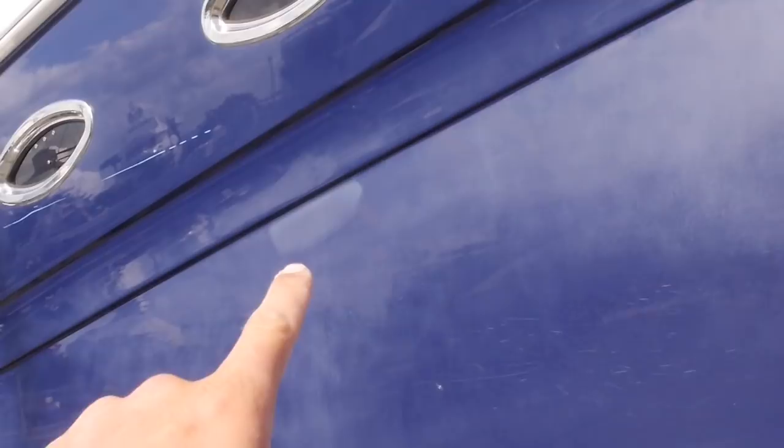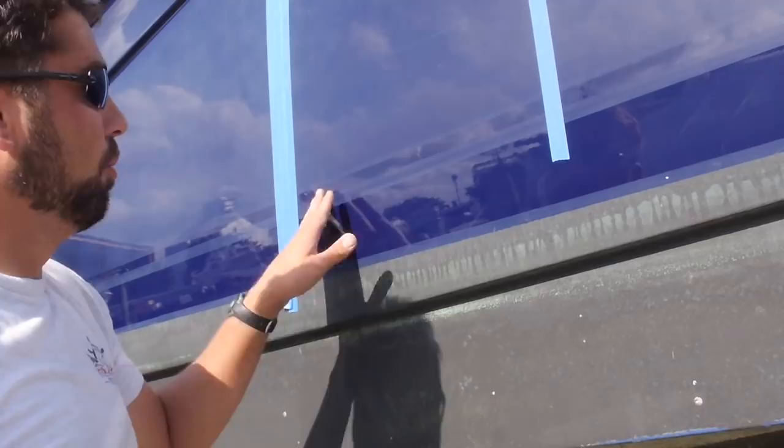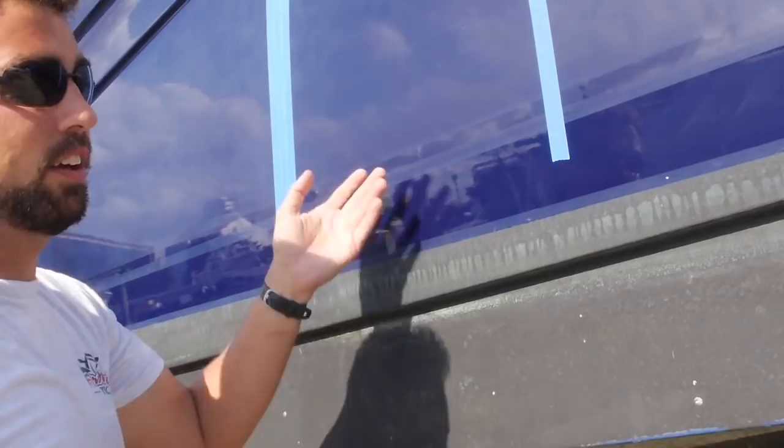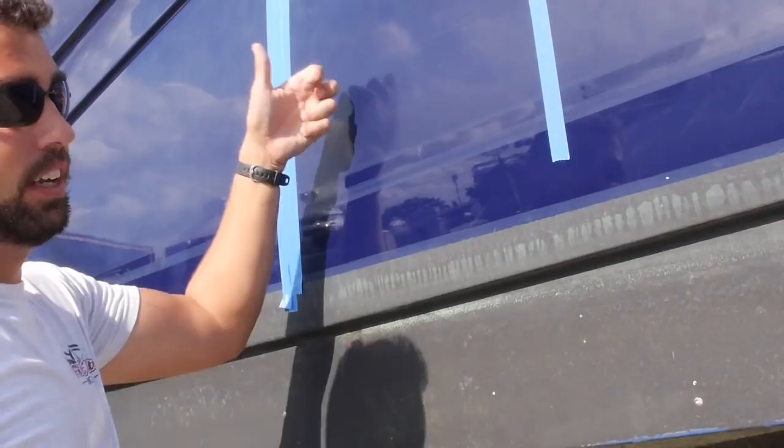We just have some really, really wicked oxidation. There is an existing gel coat repair and just nasty, disgusting oxidation. We'll do a quick little preview — another tough spot we were doing over there — but this is the definition of chalky and dried out. We're going to focus on the area just under that gel coat repair. I think that's the worst area around, so that's where we're going to go. There's a drastic difference here as well. The boot stripes have been on for the life of the boat, so we'll call that 10 years. A huge, huge difference in weathering of the gel coat. This is almost unweathered — this is what it should look like. This is what neglected looks like. It's going to be extremely difficult to make that go away. It may not be possible.